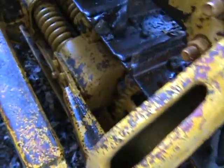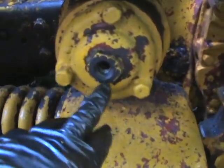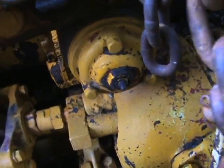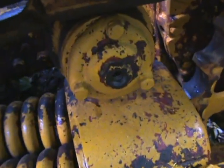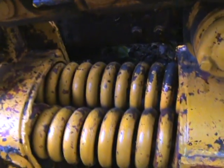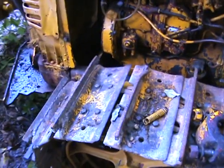The previous owners had replaced the button-head oil fittings on the rollers and idlers with regular grease nipples instead. I have to get new button-head fittings from McMaster — and I ordered the wrong size. These are quarter-inch NPT and I ordered 3/8, so I'll have to reorder.